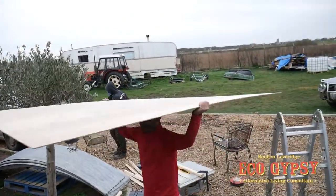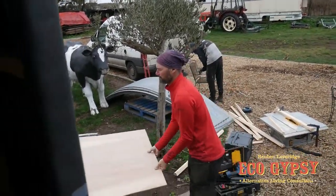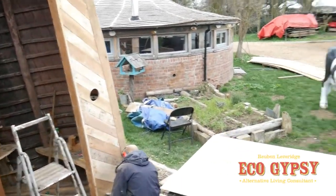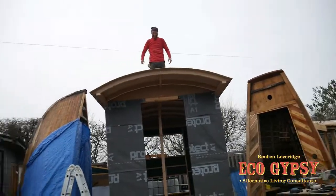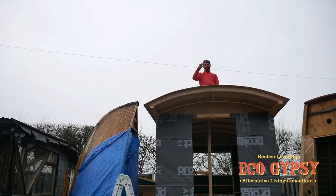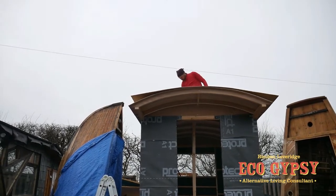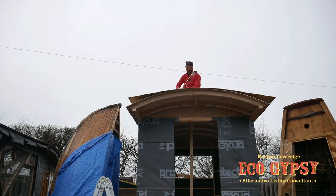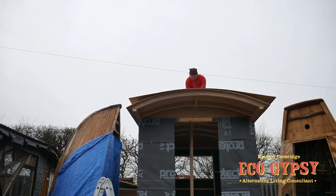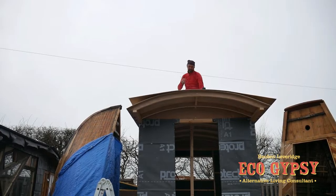We've done really well. Last sheets are now going on the roof, so hopefully it'll be watertight. We've been really lucky today with no rain, but I think it's going to turn. That's good insulation — the stuff they use is like a blanket with fibre insulation inside. I prefer that stuff. And what we've done is overlapped the joints as well, so the joints overlap sheet to sheet. Insulation stapled on, then there'll be a membrane on top of that, then the battens, and then the tin. Starting to take shape now.